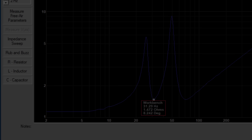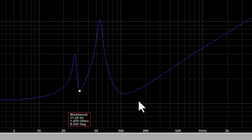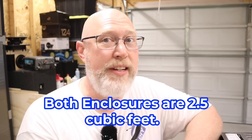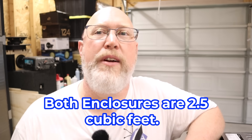This is the double-eight box. These two are within human error of each other, so we have two boxes that are for all practical purposes really close to the same — and they were designed with that intention. Both boxes have a front-firing subwoofer and a side port, and both are very nearly the same airspace.